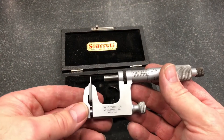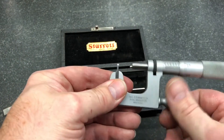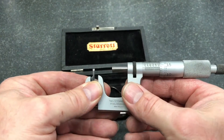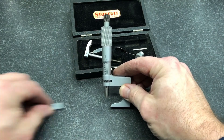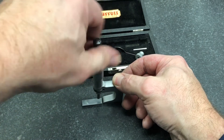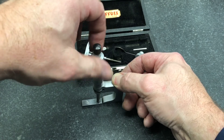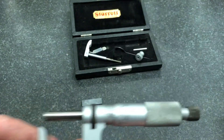What's really cool about this is it's like a transformer — it can transform. I can take this piece off on the bottom by unscrewing the shaft and pulling these two pieces out. Now this becomes a one-inch depth mic. If I had a step and I wanted to measure it, I would hold the mic down like this, rotate, and use it as a very close-quarter depth mic. Mold making and tool and die guys use this all the time this way.